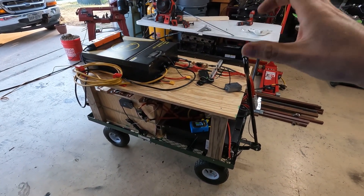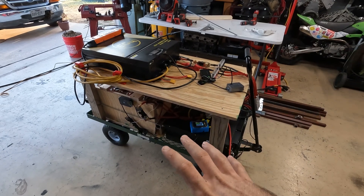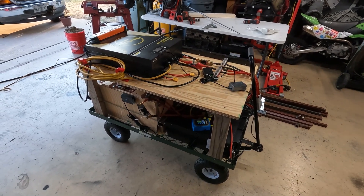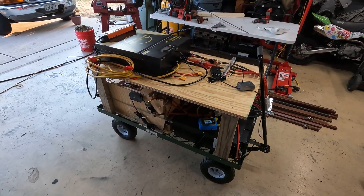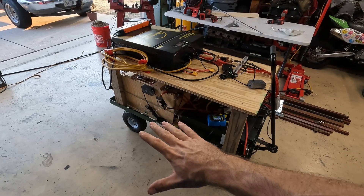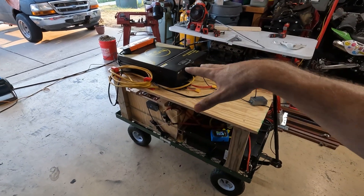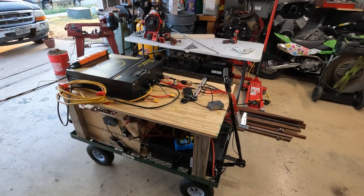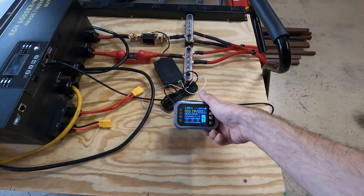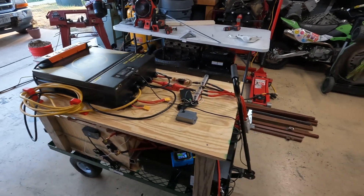This thing has been 100% reliable. I've been running it for months now — the inverter has been on continuously for a few months with zero issues. Batteries, everything's working perfect. We're just gonna take this apart and package it better. I'm gonna build a nice rack scaled off the battery size: the big 16s battery on the bottom, the server rack battery on top with its own mount, then some sort of top platform, with the inverter standing straight up. I have a little box printed for the control panel main display.